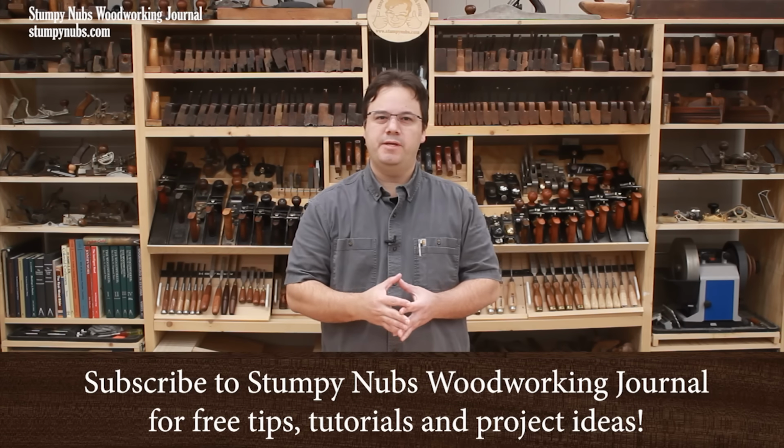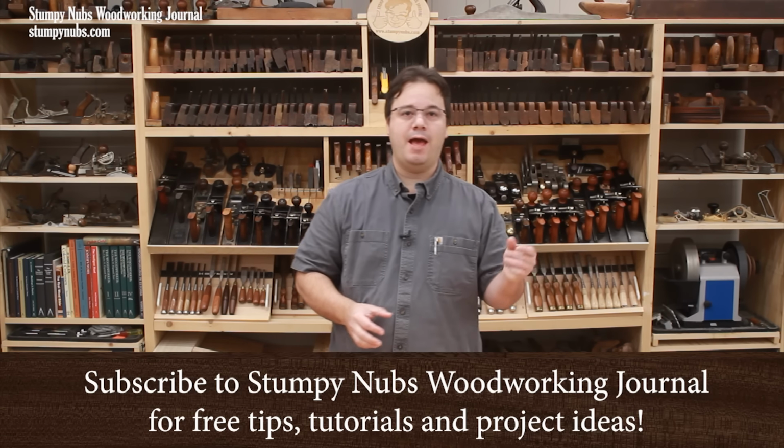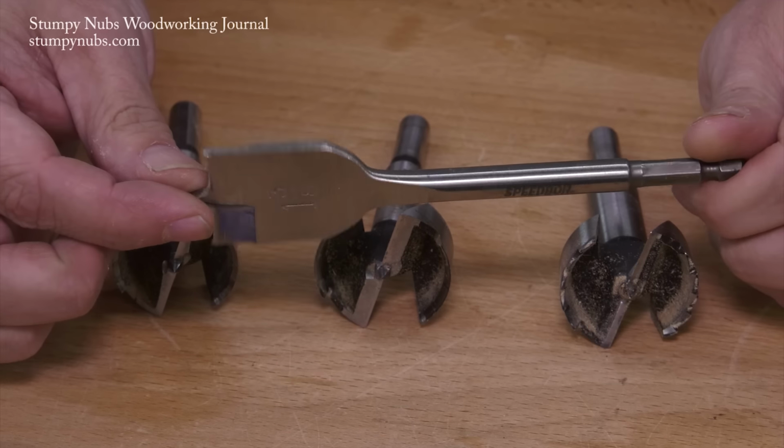In woodworking, drill bits are for small holes, usually up to 1/2 of an inch, and larger holes are usually bored with hole saws or spade bits or Forstner bits. We can make a whole video about when to use one of these over the other, because there are times when I prefer a hole saw or even a spade bit.